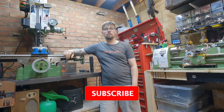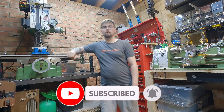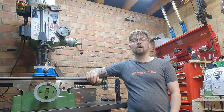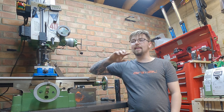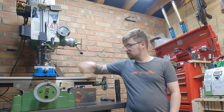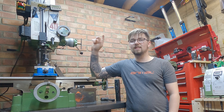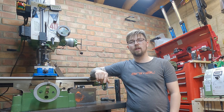Hi there and welcome back to the channel, Machining with Joe, a channel where I share my journey as a beginner machinist and any tips and tricks I pick up along the way. Last week I got the mill all set up, the head trammed, and the vice all square to the table. The only problem I've found so far is all the measurements on this thing are imperial, so the handwheels are actually measuring in thou. I've ordered myself a DRO kit which I'll be fitting at a later date.